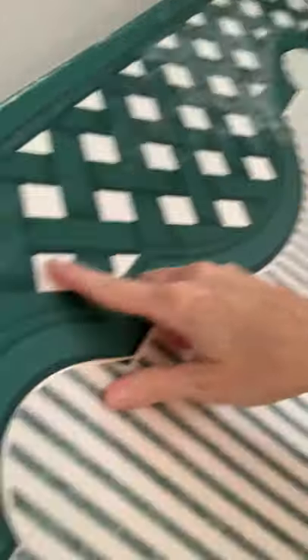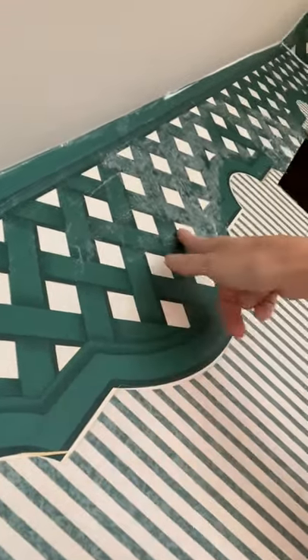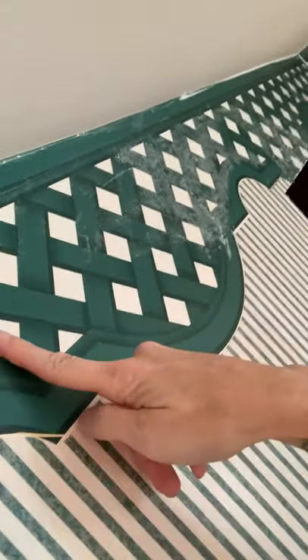The part that's a little bit harder to do is your seams on your walls. This room is going to be — there's no other way to say it — a real challenge because of this border. I truly hate this border. It looks like it's solid, but when you actually get up on a ladder and look closely, each of these sections is actually cut out. So it's not a solid border. Each one of these is going to have to be filled in with joint compound so that it becomes a solid surface.